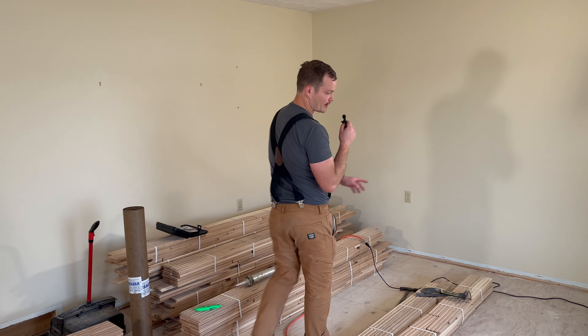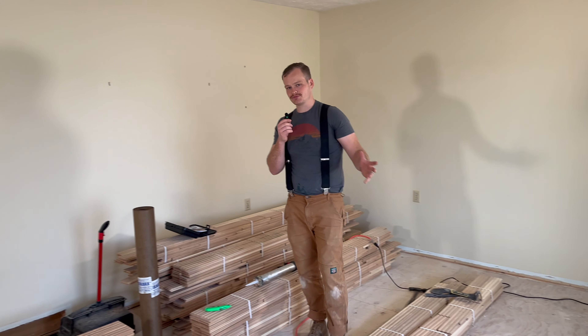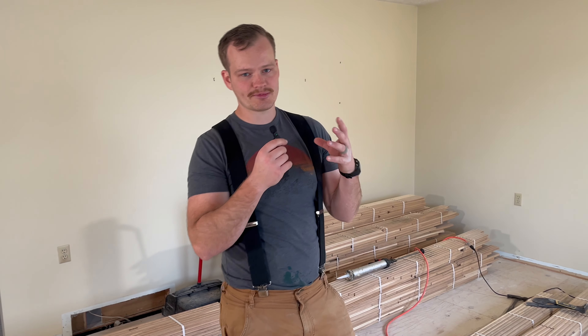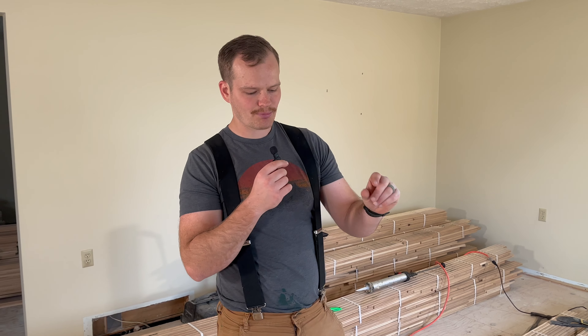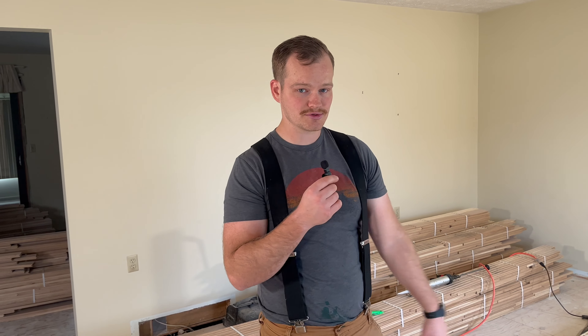You can see we've got the baseboards off over here. Unless there's some special circumstance, you always take the baseboard off when you're installing hardwood floor, and you want to know what trim is going back on. If you're just doing baseboard, that's usually going to be five-eighths of an inch thick, meaning your boards must all be that close or closer to the wall. If you're doing baseboard and shoe mold, it might be more — just know whatever you're going to be using so you can keep your gap within those limits.